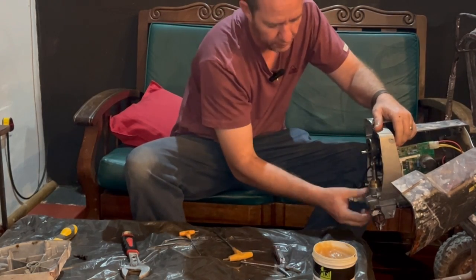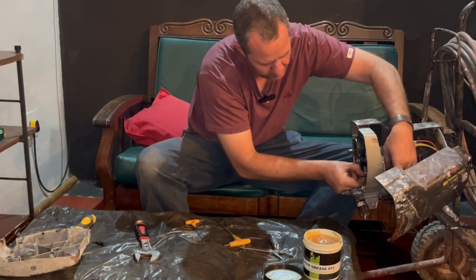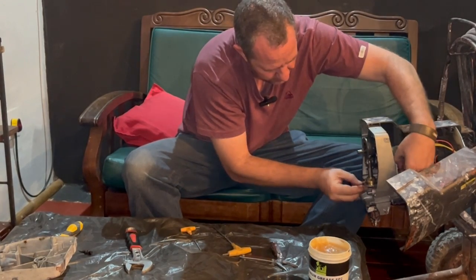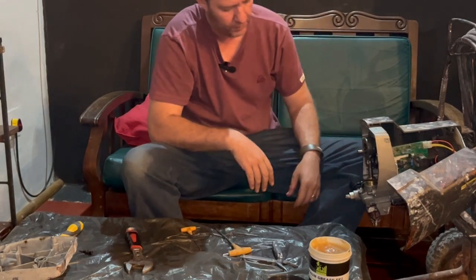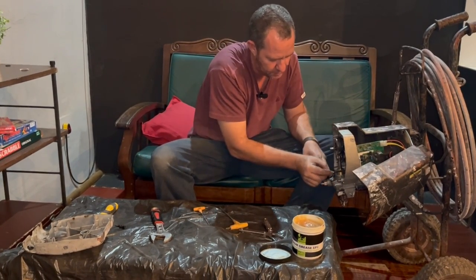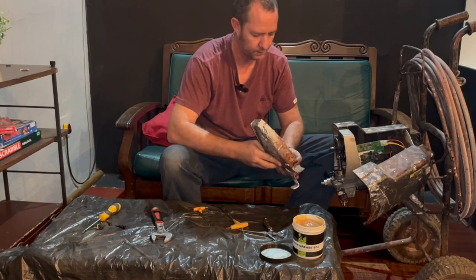Okay, so it's very important that this whole pump housing slides all the way back and hits the aluminium bits at the back. So this little cable is running in a place where I don't like it. So I'm just going to bring it to the front rather and put it back around there, where there's a safer spot for it to run. Okay, so that assembly is almost done. We've just got these two little spacers that go onto the front of those two pistons there. And that's the lot. Now we need to attach the cable.